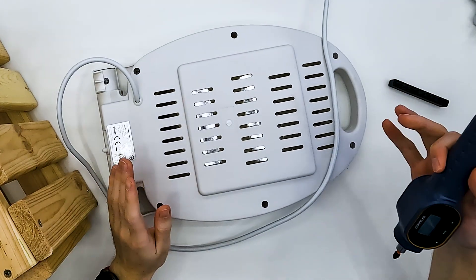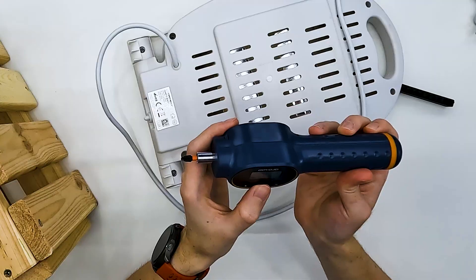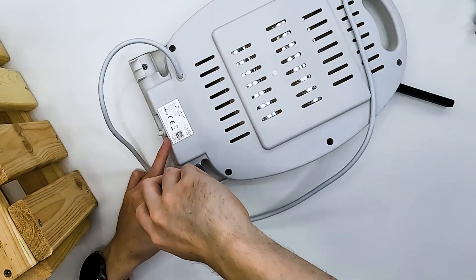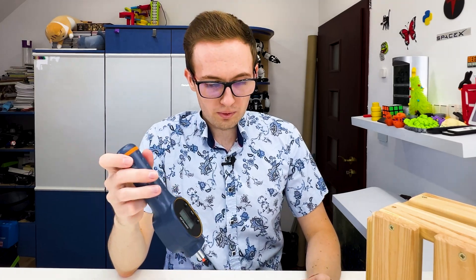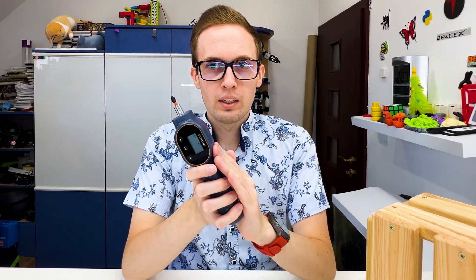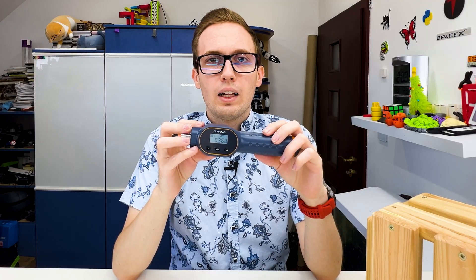For the other scenario, I have a plastic part with screws. In track mode the value is too small to measure, so let's go to peak mode. I can see I used 0.3 Newton meters to screw this screw into the plastic. You can set the preset to 0.3 or 0.25 Newton meters to be sure you won't destroy the plastic by screwing too hard. A useful device — not a wrench, just a screwdriver — but if you want to make sure you screw correctly, it's good to track and measure the torque. That's all for today, like, subscribe, and be nice.